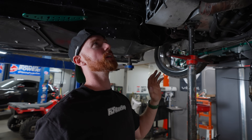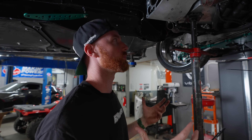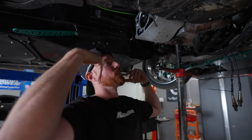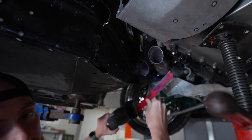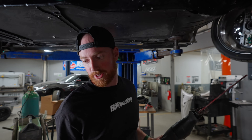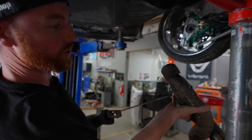Going into this project I had minimal confidence, but I knew that once I started I would begin to see the greater picture. I started with scanning the whole underside while the exhaust was assembled. Then I took a huge sawzall blade and started a cut like this, because the sawzall blade allows me to keep a plane — whereas if I used a zip cut, I wouldn't be able to do that. I also added tacks holding all these runners that were slip joints together.